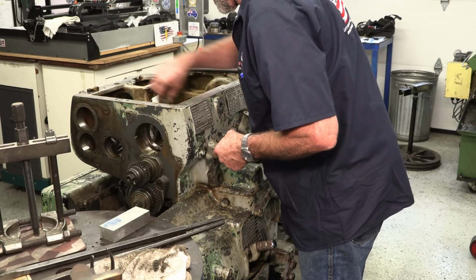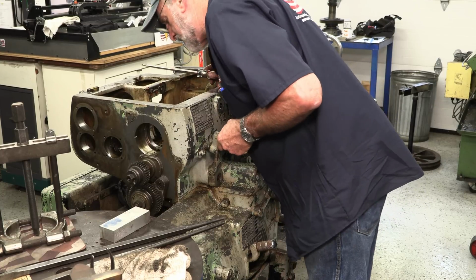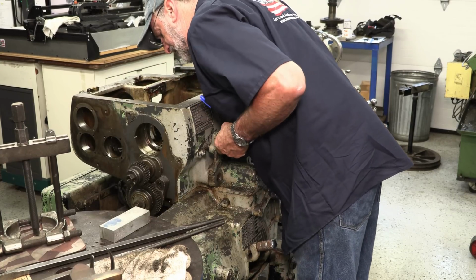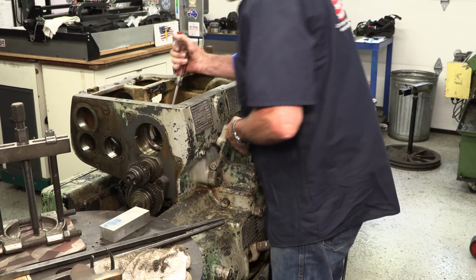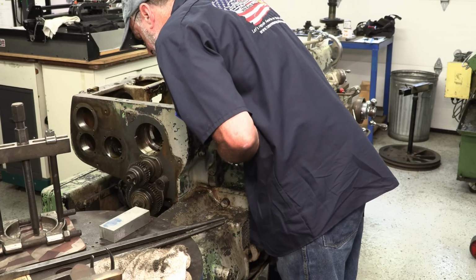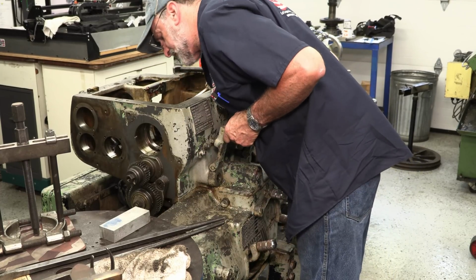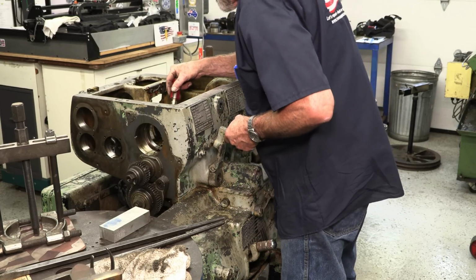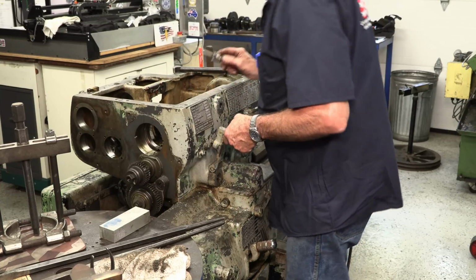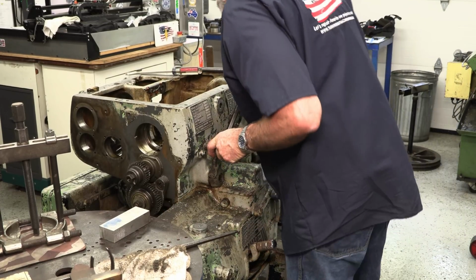Okay, same thing on that one. The yoke, now that that other gear is off there, that yoke can actually come off. You know what it is, it's the set screw that locks the collar in. It creates a little burr and then drags out the housing. All right, we'll gingerly pull that out.